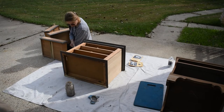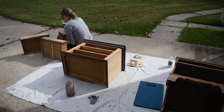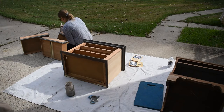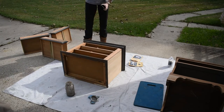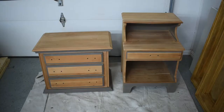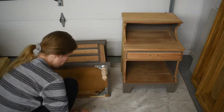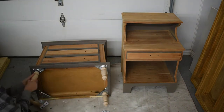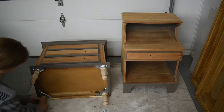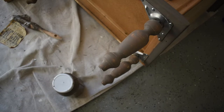I applied the paint on all of the trim pieces around each of the drawers, as well as select surfaces on either dresser. These are obviously in very different styles, so it was kind of up to my choice about what I wanted. The guidance here is to get about the same proportion of wood to paint on both pieces — if you apply this paint strategically, it's really going to help meld these two together and make them look like siblings. I also decided to add some feet to the three-drawer dresser to give it a little extra boost and make these pieces close to the same height. I got these at Lowe's — they screw into the bottom with a standardized size adapter. These came as untreated wood and I was tempted to stain them, but standing them up side by side, I decided paint would look better.